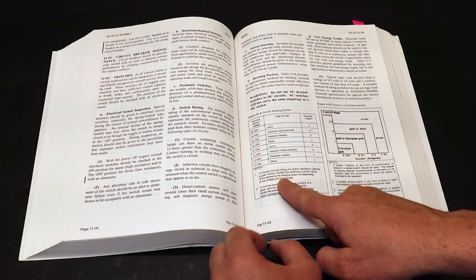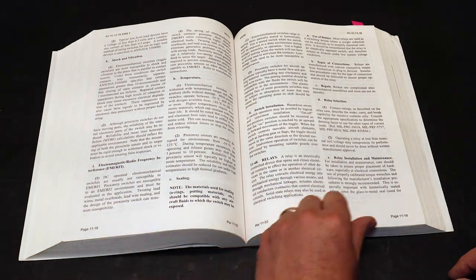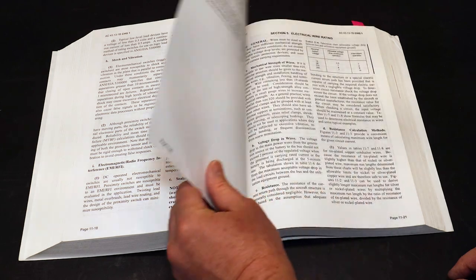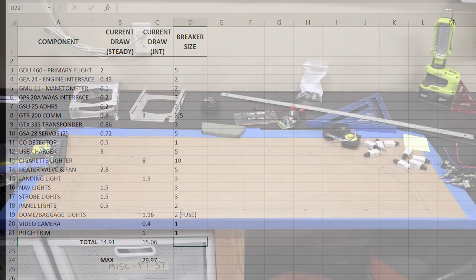It's a little bit of a process to determine the proper wire size, as length, operating temperature, intermittent versus continuous, and whether it's in a bundle or conduit are all factors. But it's worth going through the calculations so as to not overtax a wire, which, if not big enough, could possibly cause a fire someday.